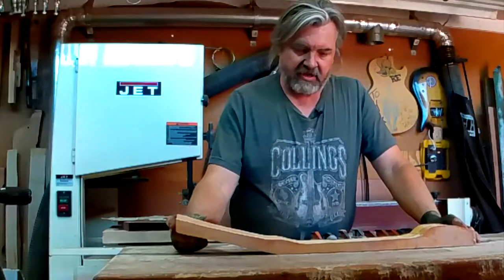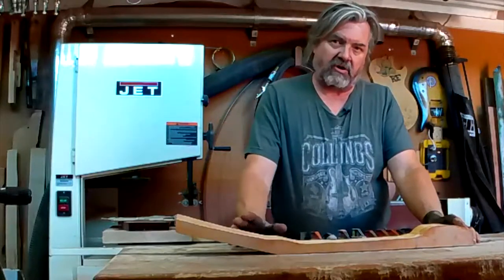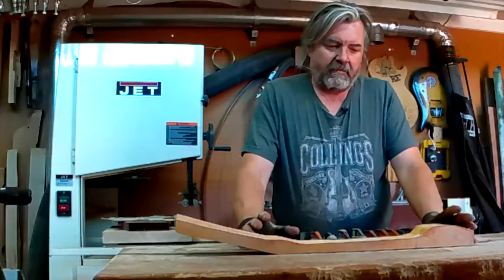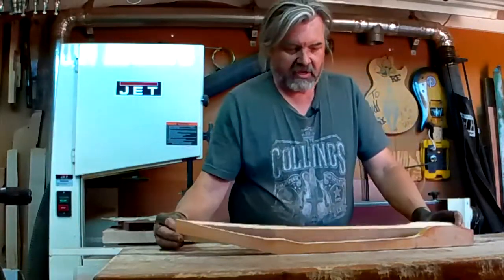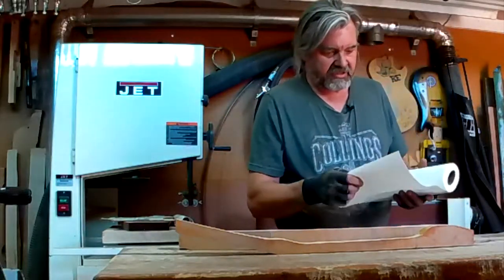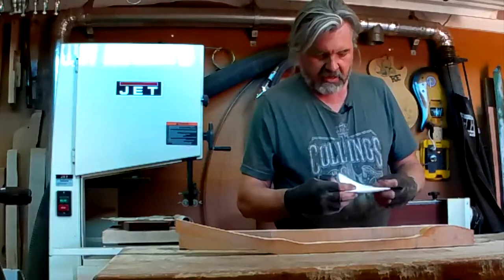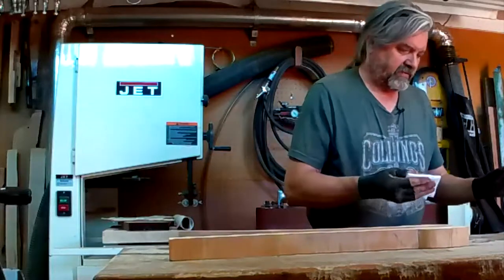And the same thing I did with the walnut, I'm going to do with the maple because it's such a hard wood. It's so hard that I like to glue both pieces. And again, I'm just trying to get that adhesion. On a piece of maple, I'll actually take a paper towel with a little water on it, and I'm just going to kind of moisten the surface that I'm getting ready to glue.